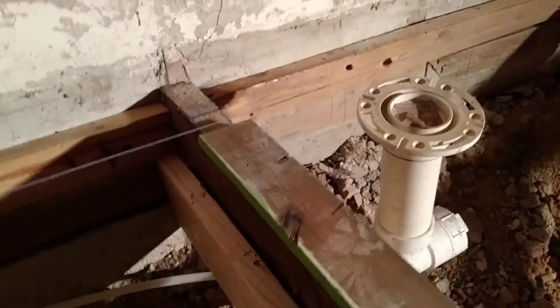The problem I'm having is, looks like this joist that I'm on that I chose to keep in here because it was at the 4-foot mark is right at it. So the thing I'll do now probably is see if this piece of 3/4 pine that I'm using is true equal to the subfloor, sorry, the OSB subfloor or not. So let's carry it over here and we'll just do a simple test.